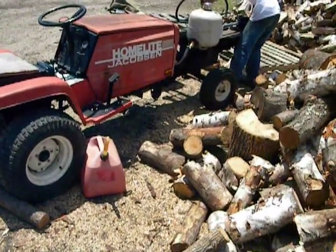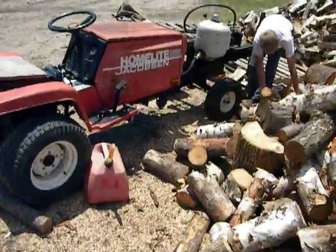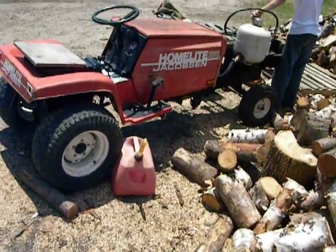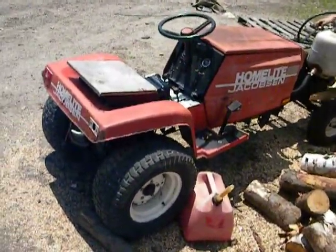You need to use that, but that's really cool. 22-second cycle time, maybe 23. This is like a 12, 13 — a 16-gallons-per-minute pump. You can drive it around still because it has a hydrostatic transmission — didn't affect anything on that.